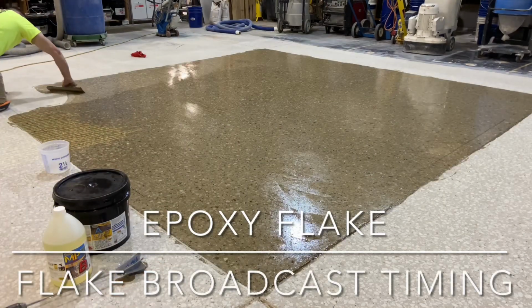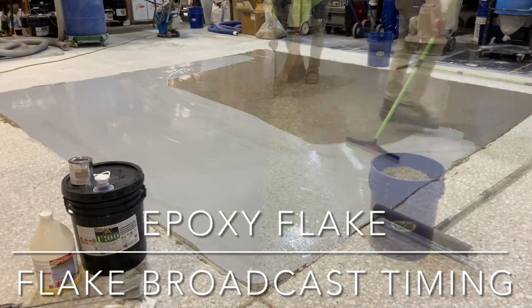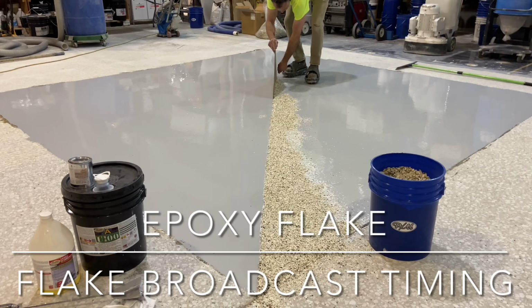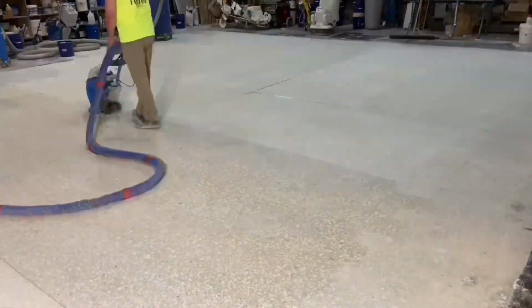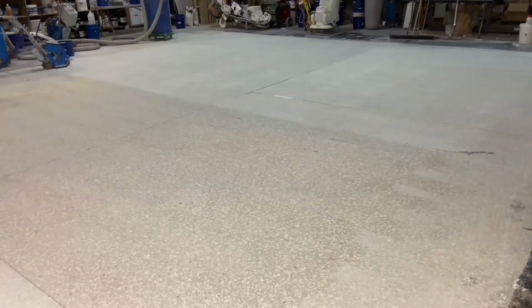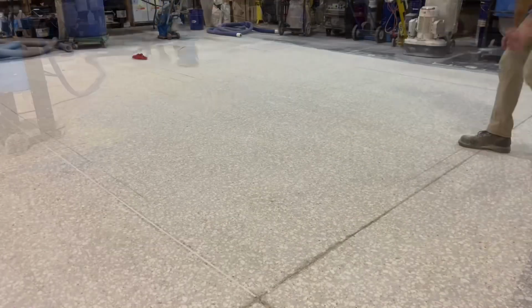This video documents a comparison of results from a flake thrown into a fresh epoxy body coat and a body coat given more than an hour before the flake is broadcast. Before the coating demo, the area is de-dusted by shot blaster to remove all grinding dust.